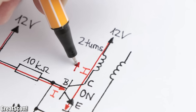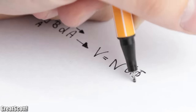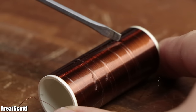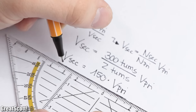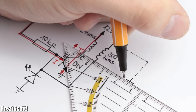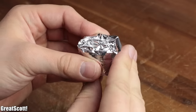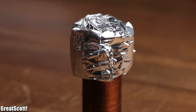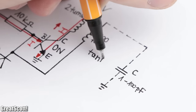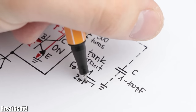The increasing current of the primary coil creates an increasing magnetic flux density, and thus an increasing magnetic flux, which induces a voltage into the secondary coil. Due to the large number of turns on the secondary, this induced voltage is a lot higher than the original 12V DC we applied. Next, we must add a parasitic capacitance to the circuit, which in many Tesla coil designs is increased by adding a metal top load to the coil. Either way, this capacitance is a very small value, which cannot be ignored, because it creates a tank circuit with the coil that naturally oscillates at its resonance frequency.